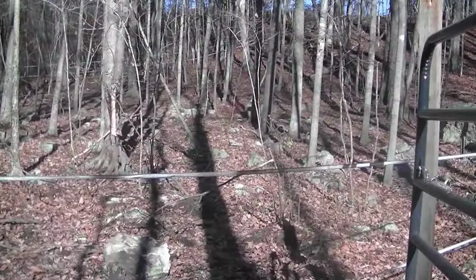And if you guys ever do this, I did it the hard way. It was just a stupid mistake. Luckily, I caught it right away. Just when you're cutting your angles, when I originally did it, I just kind of laid it down like I was cutting a straight piece and did my angle. And you really got to make sure that you stand it up the way it's going to be standing when it gets installed, so that you have the correct angle. So don't do what I did on my first piece, but luckily I was able to reuse and salvage the piece and just make sure it's set for those angles how it's going to be set when you lay it in.